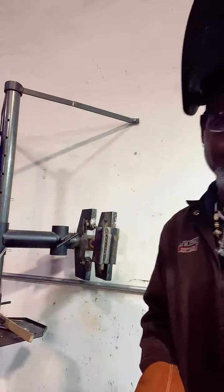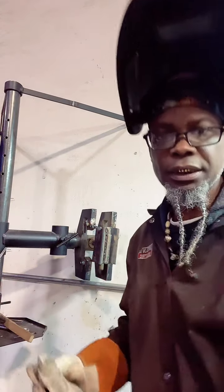I tacked it on there, fam. I like a nickel landing. 3/32nd gap if it's an open root. And that'd be pretty good. A nickel landing, 3/32nd gap. Yeah. Let me clean this up, fam. I just knocked this one down. Let me clean it up.